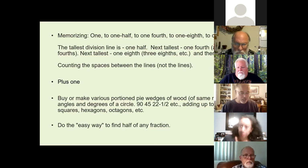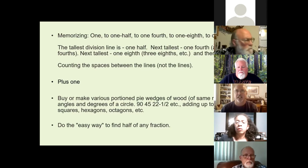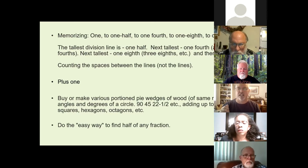and it's something I do, and you guys might find this familiar. It says here, sometimes if I'm taking a measurement and I don't want a chance of a misread, which happens, I do it. I mentally call out the fraction as maybe the inches, and then instead of a 16th, it could be like 12 5/8, and then you go +1, and that +1 is a 16th. It's not something that I teach, but it's something that I will do every once in a while for myself if I'm in a hurry, so I don't forget. Sometimes you measure something and maybe you forget if it was 9/16 or 11/16. But if you measure something and you go, well, that was 12 5/8, and then I need +1, for some reason, it's a little easier to remember it that way.